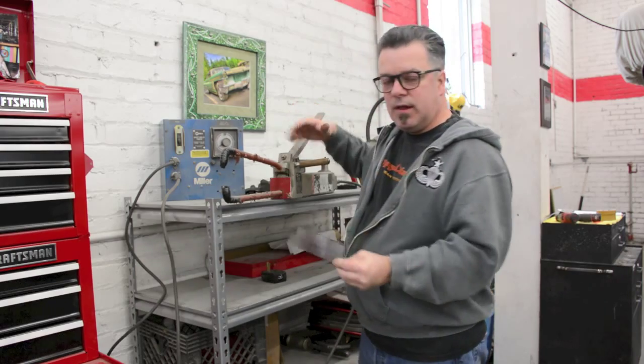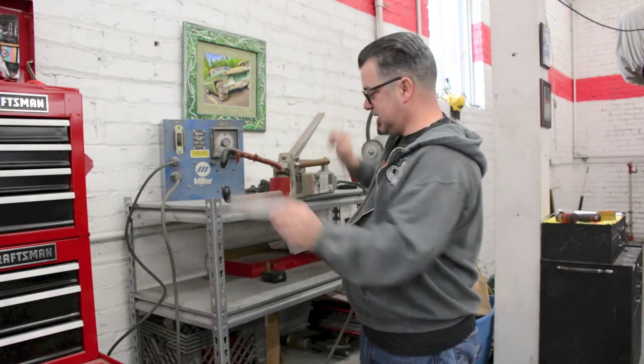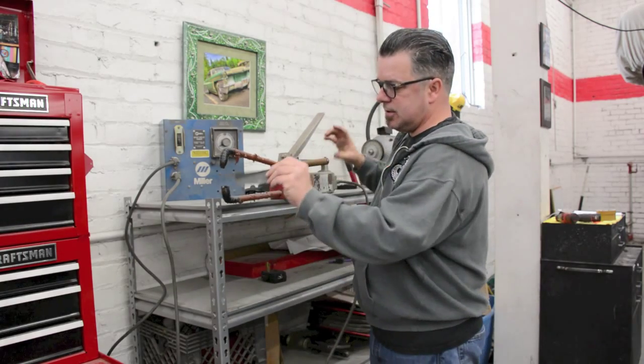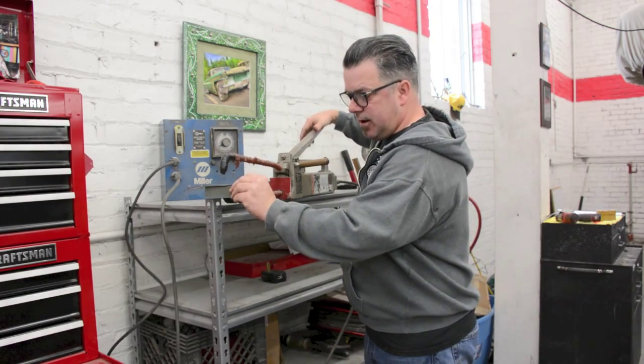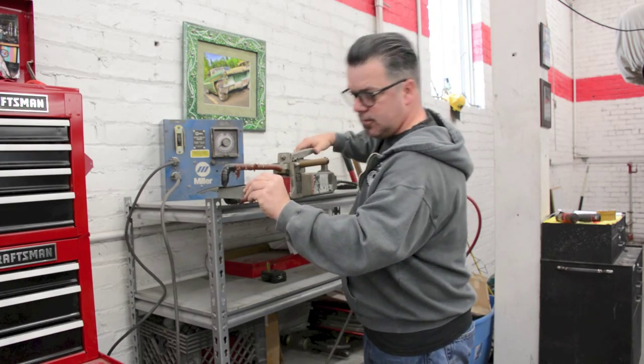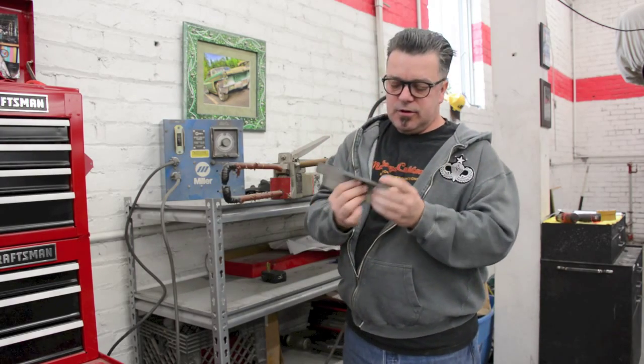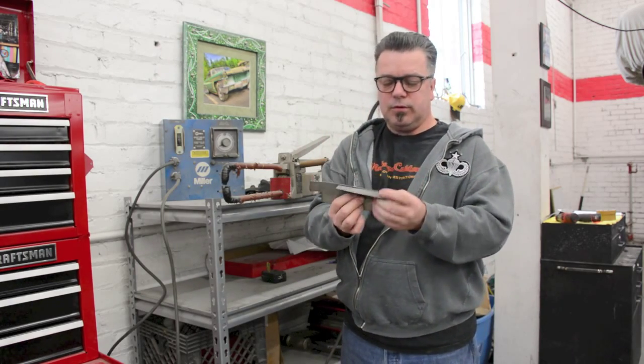and somebody would have one of these on a gigantic articulated arm to counterbalance its heaviness. This thing's heavy, this weighs about 80 pounds. And he comes down and he resistance welds all over the place. Buzz, buzz, buzz. And these two things come together. Now these would be 2 virgin pieces of metal with no distortion in them.